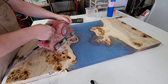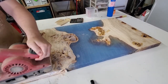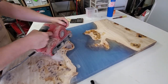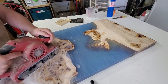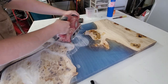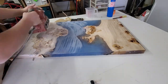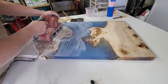After flattening I sometimes use this little handheld belt grinder — it's got about 36 grit belt on it. It's very fast at removing material, so you definitely want to keep it moving or you'll ruin the flattening job you spent a long time doing. I'm just quickly going over the high spots the router left, and then I can move on to the hand sander. This just speeds up the process a little bit.